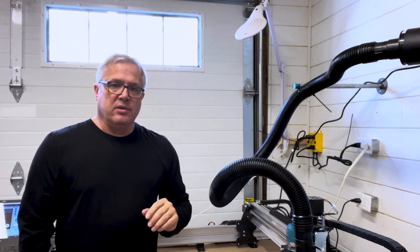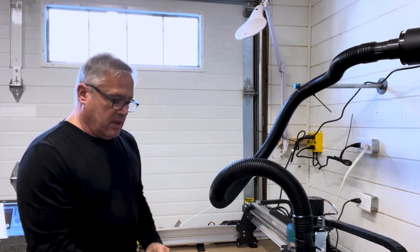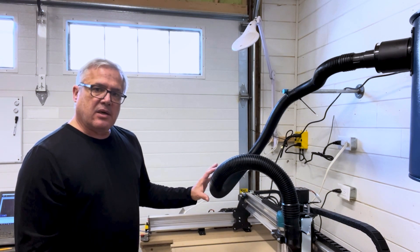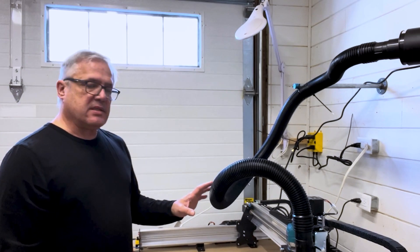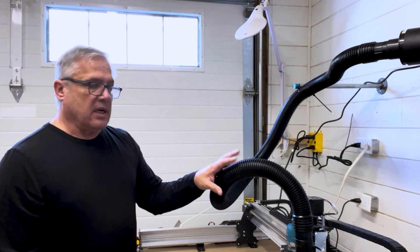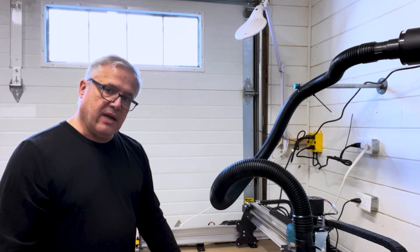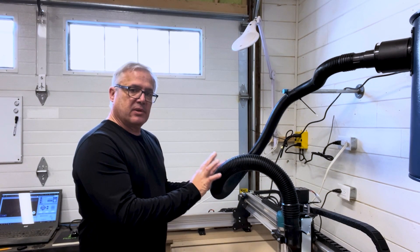One thing that you'll have to do before you fix anything is to run the machine in its lowest position all the way around to make sure that the dust hose doesn't get caught on any of the components. You probably need to do this several times. What I did is I ran a surfacing cycle with the dust shoe and the dust collector working, just making a zigzag or spiral pattern from the inside out when doing the fly cutting for your spoil board, just to make sure none of the components get caught up with the dust hose.